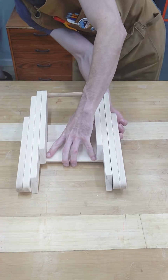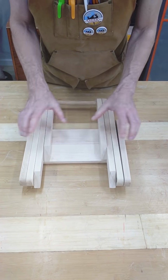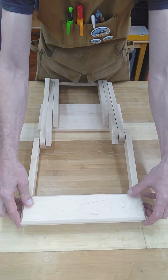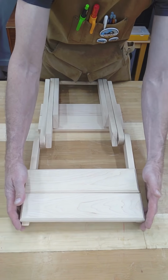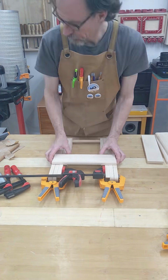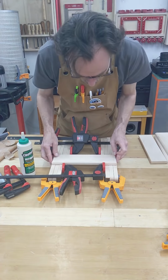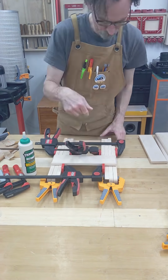Flip the stool over and glue the other two seat boards to the outside brackets. Also glue the legs connectors in place, about 40 mm above the floor. Sounds simple, right? But in reality this glue up was awkward, as you can see. I used clamps as clamps and clamps as spreaders.